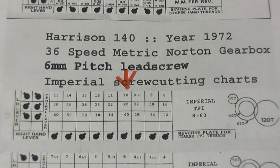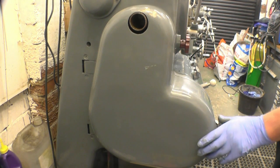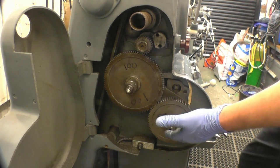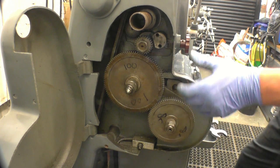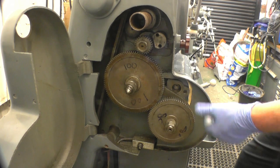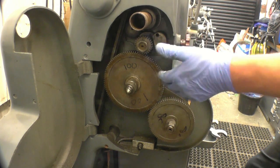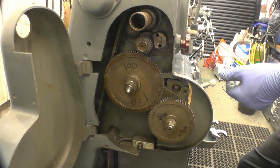We'll have a look in the back of the lathe — I put the gears on. This is the gear case on the back of the Harrison lathe where the change wheels live. At the minute it's set up to cut metric; I've never had to change any of these yet. I did it quite regularly on the box-fed lathe for cutting metric threads because that was an imperial lathe. I'm going to go the other way around here and try to cut an imperial thread on a metric lathe.